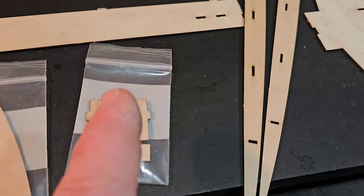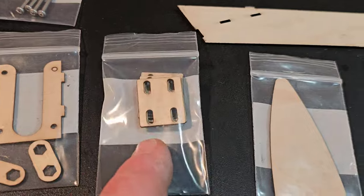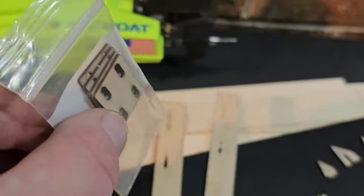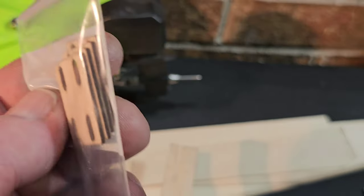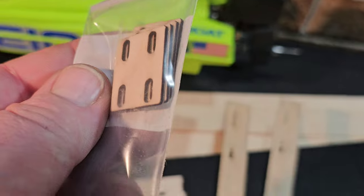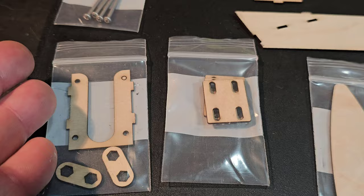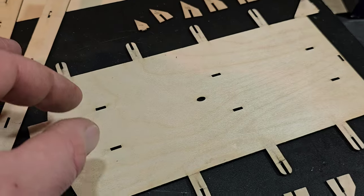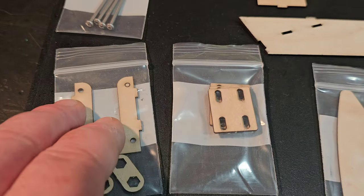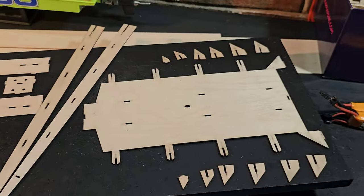You got your servo mount. The front of your cockpit you have to completely custom make — make it your own. These are shims for trimming the motor. We're going to grind some angles on these shims so we can get some positive and negative angle if needed. The motor mount Dr. Jet recommends is a little aluminum drone motor mount — we're not going to go that route. There are also nut plates for the motor to make it easy to tune.